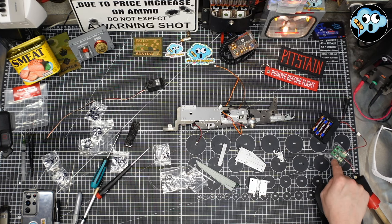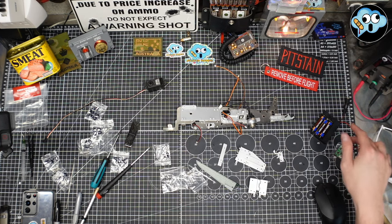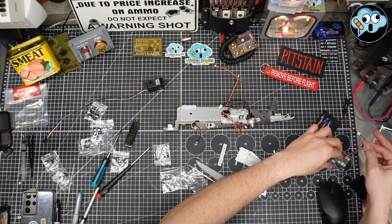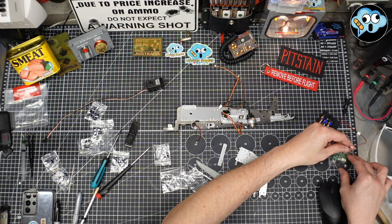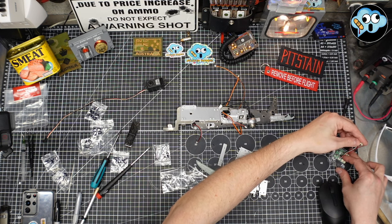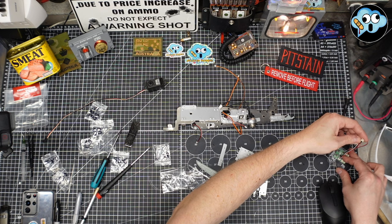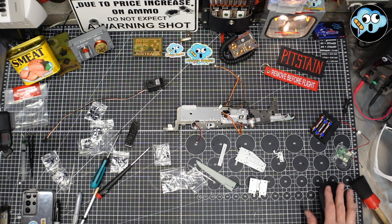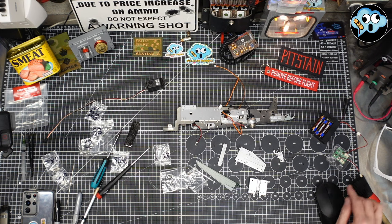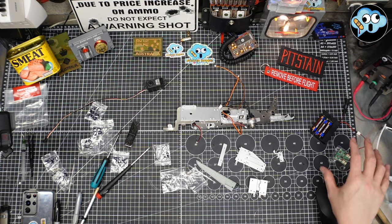Clearly, I guess when they were making the testing circuit board in China, they reversed the polarity for the positive and negative power to the servo, or something got reversed. I could decipher, I don't know, not much. It was the control... Your positive and negative shouldn't matter. It was the control lead was in the wrong pin. That's all. But that's why they have this little adapter harness, I guess. It's cheaper to make this harness than to make a whole new testing board. And all that PCB is way more money than doing this.